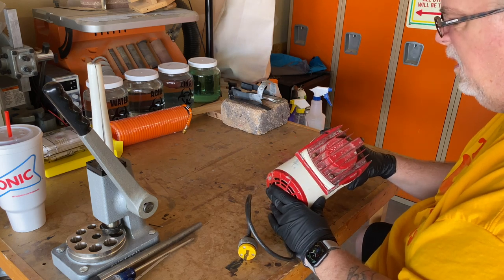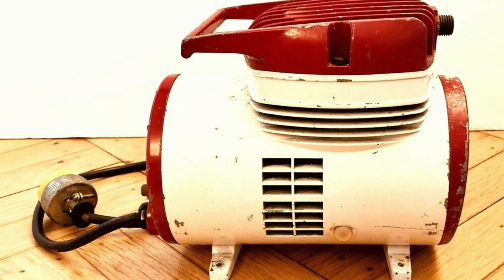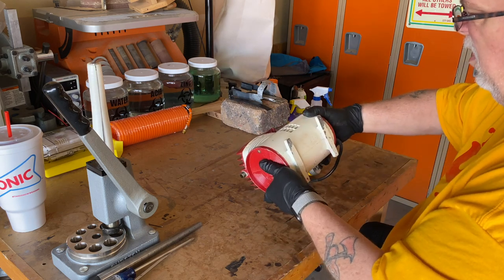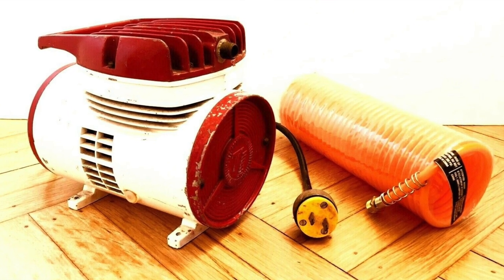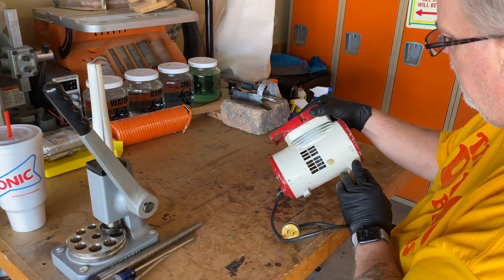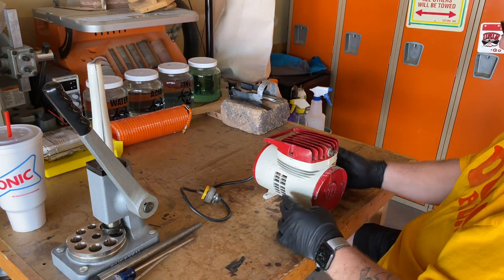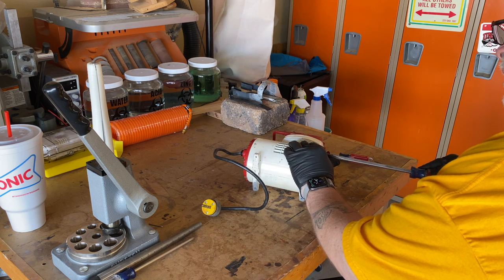To achieve torque at the motor shaft, an AC current is applied across the stator. This creates a rotating magnetic field, which in turn induces a current in the rotor. Because of this induced current, the rotor also creates a magnetic field, and it starts to follow the stator due to magnetic attraction. This motor is very ingenious, and I highly suggest a quick Google search for a better explanation than I can provide.